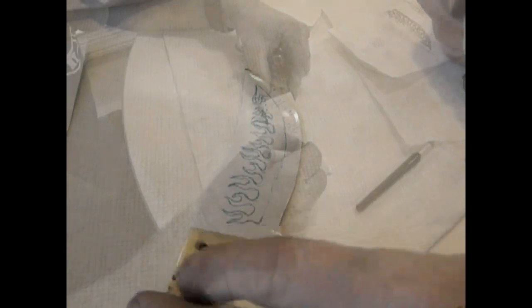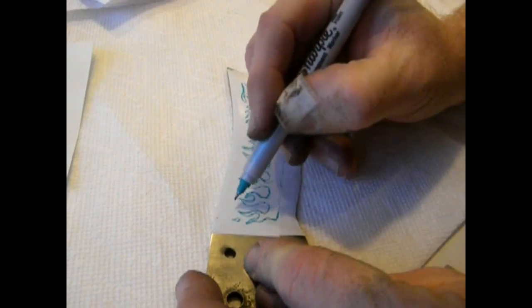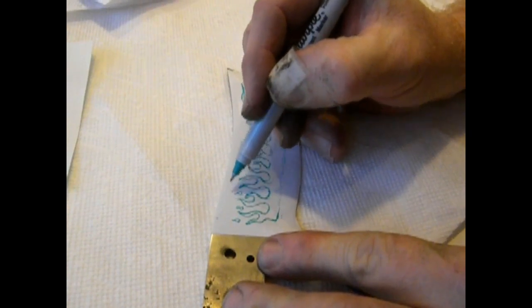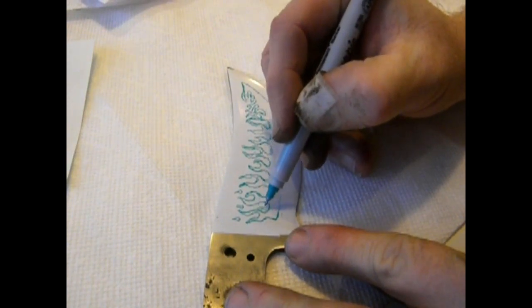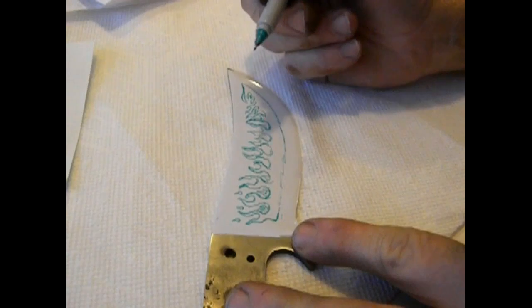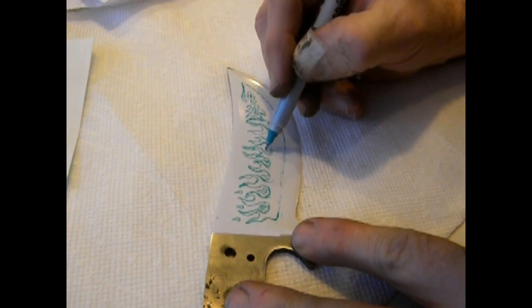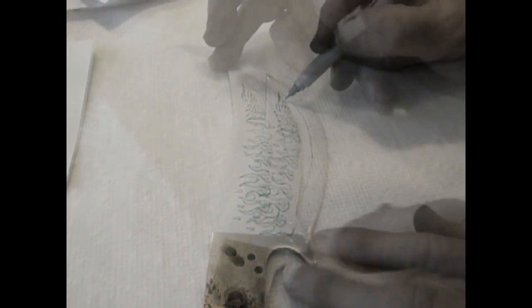Remember that this etching is going to eat into the blade, so you really don't want to etch too close to the actual sharp edge of the knife. You want to keep the etching about a quarter inch or so away from that edge — you just wouldn't want to damage the edge or have the etching eat through. Here I'm using that same fine marker to draw the background flames as well as the embers floating around. It's these background flames that, when we remove the vinyl from the main set of flames, we're going to leave covered with vinyl until after the first etching. So those background flames will be etched for a shorter amount of time than the primary flames — that's how you get the two-tone effect.